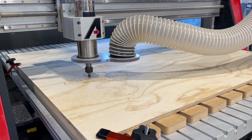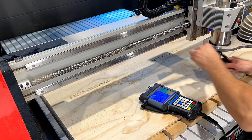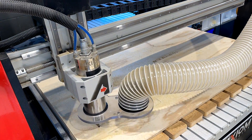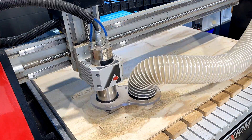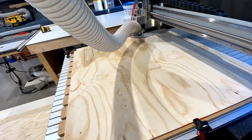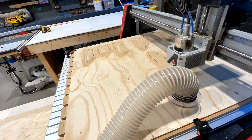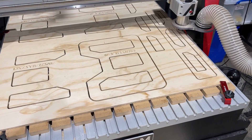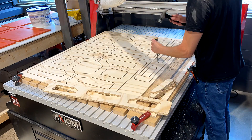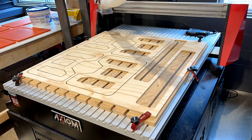I've loaded the material into our CNC machine and we're cutting with a VCarve bit — I believe either 60 or 90 degree — and then switching to a down-cut bit to actually cut out the panels. I managed to fit four different panels on one sheet, which makes this job a lot easier. This is probably at least an hour and a half to cut all these panels out. My CNC machine doesn't have a vacuum table, so I have to use tabs, and at the end I just go over with my chisel and mallet, carefully breaking those tabs and removing the panels.